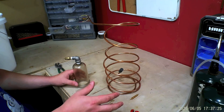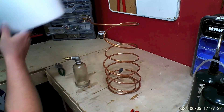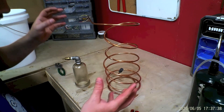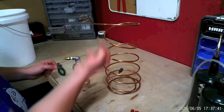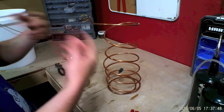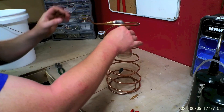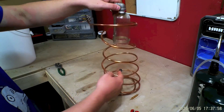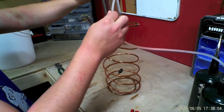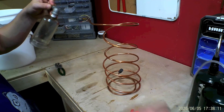One of the things I'm going to have to do to cool down the gases is put it through this pipe. This pipe will be submerged in water inside of a bucket, and the gases will come through, cool down, contract, and the bubbles will go up through the water. The bubbles have a lot of surface area, which means the water will grab a lot of particulates, further cleaning the gas. At the top, I'll have bubbles going up, and then I will have my tubing go from here into either the pump or directly into my propane tank.